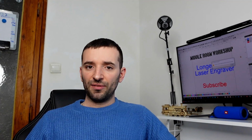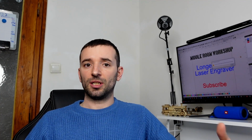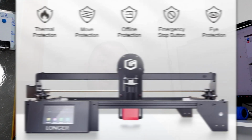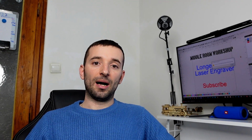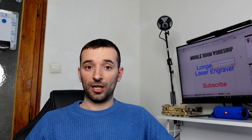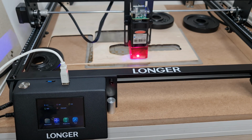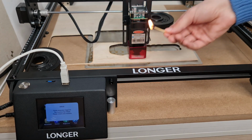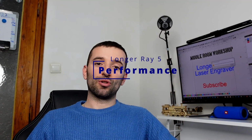The machine comes with a bunch of safety features, some of which are common with most machines, including the tilt protection and also the shock protection, which will prevent the machine from overdriving. But the one that really caught my eye is what they call the thermal protection, but it's more like a fire protection. Basically, there is an infrared sensor that, if it senses high temperature or an actual flame coming out, will basically stop the machine. And so this will prevent the machine, the surroundings and the material from catching on fire. And this, I have to say, is a cool feature to have, especially if you leave the machine unattended, so you can have extra peace of mind that if something goes wrong, this safety feature will kick in.